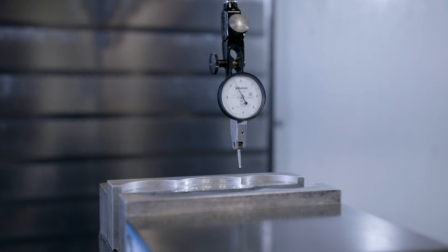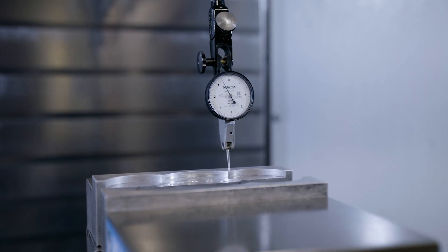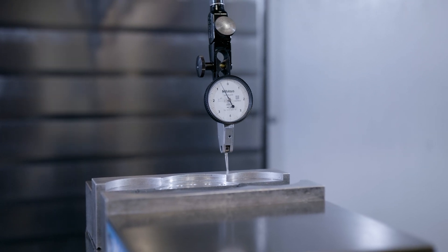Furthermore, if you can get accurate measurements on where the back jaw of the vise is located, you can document that so you can use the round pin as your X/Y zero and the top of the Z pad on the PPS base as your Z zero — so it's already set up in your CAM system. You won't have to do any offsets in Y; in X, typically yes, because you'll use a work stop on one side of the vise, but you won't have to indicate it or give the Y value. You can keep that saved in one of the multiple work offsets in the control.